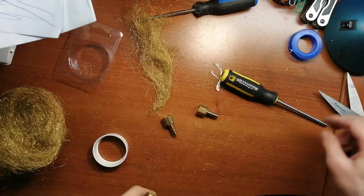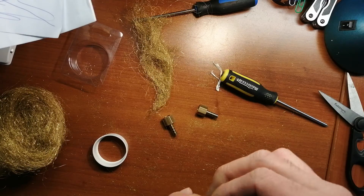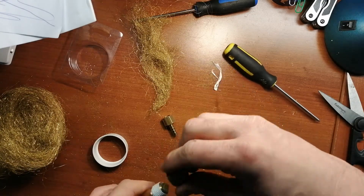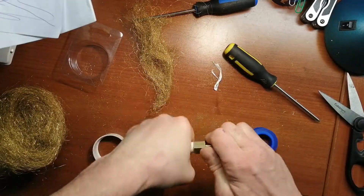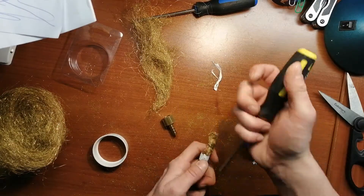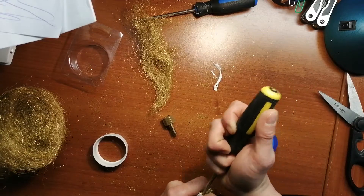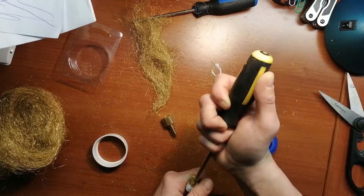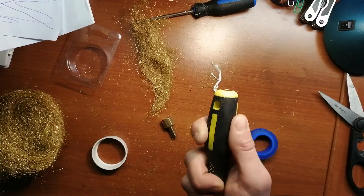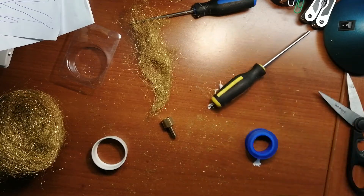So I'm just going to take the other side off here and add some thread tape — nice and sealed up. I'll put my other cap back on and tighten it down better after. Before you put your last cap on, you don't want any air gaps in the top of it. As you've seen when I pulled it apart, a bunch came out of one end but not the other. You don't want that to happen because then you've got an air gap in there, and you want that as little as possible.